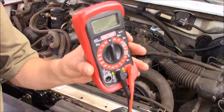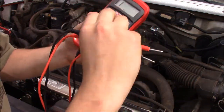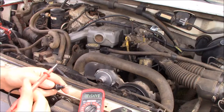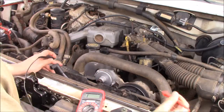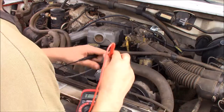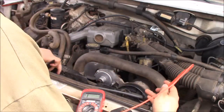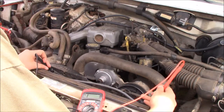What you want to do is take it and set it to 20K ohms — see that little symbol that says ohms. Basically, we're going to be seeing if there's conductivity in between these wires, which means: is there going to be a signal that goes through it whenever it is connected? If you put it in here, make sure you're touching the metal, because if you're not, it's not going to work at all.